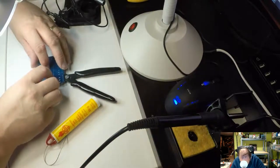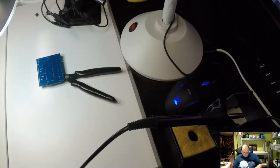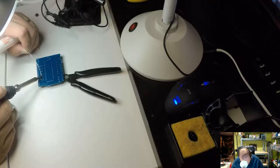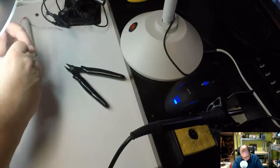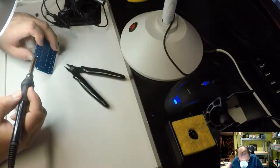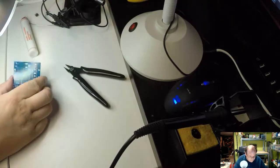And that's too high, and maybe that one. I could just get it balanced. So you need to use your tools in the best way you can. They're balancing things for the specific task. And let's hope that will just stay there long enough that I can actually get that solved. We check it. Did not turn up 90 degrees at all. So be careful one doesn't burn oneself. Okay, that's much better. So we leave it there. That's why I only soldered one, the middle pin, so that I can actually adjust it afterwards.